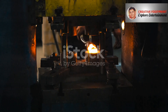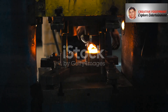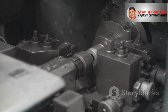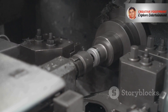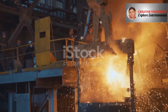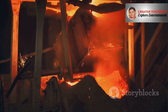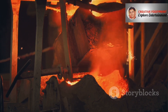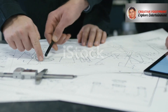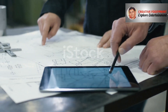So why don't we just forge everything? The answer comes down to three things: cost, complexity, and precision. Creating the dies for forging is incredibly expensive, making it economical only for high-volume production runs. These dies are machined from massive blocks of hardened tool steel and must be perfect — making just a few forged parts would be prohibitively expensive. Casting excels at producing impossible geometries in a single piece, while forging is best for parts with uniform cross-sections. For anything mission-critical, the scale tips heavily in favor of forging. As a manufacturing expert once told me, you don't pay for strength you don't need. If a cast part is strong enough for the application, is cheaper to produce, and can be made into the complex shape you need, then it's the right choice.